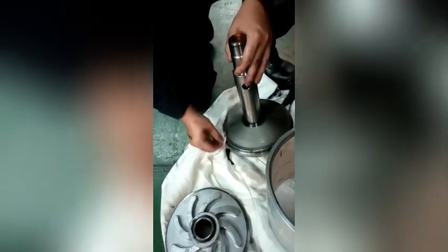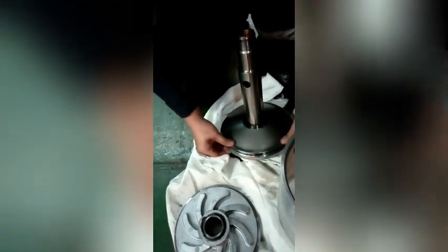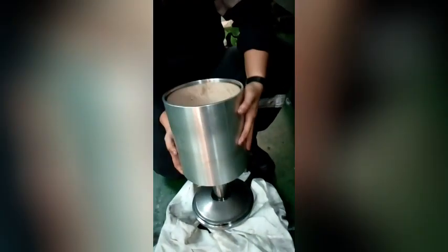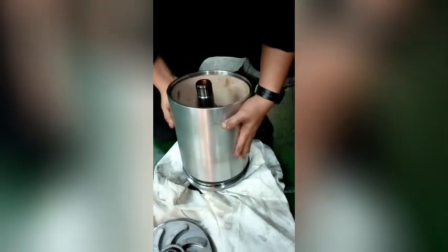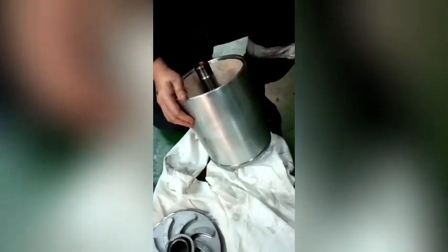Note the coupling process. While we follow through the coupling process, let's quickly talk about the centrifugal filter now. Why do we need a centrifugal filter on an engine? Note, the centrifugal filter is connected to an engine. From the name filter, what comes into your mind? Separation. When I say I want to filter something, I want to remove the ones that are not good. Now, in this particular case, we are actually separating or filtering our lube oil.